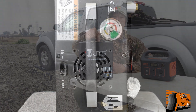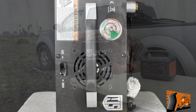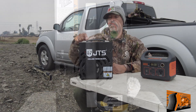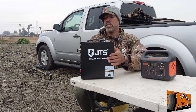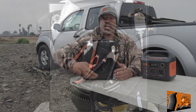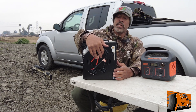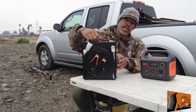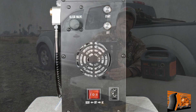There's a switch up top that lets you switch from 220 to 110, which is pretty cool. You can also set your pressure for the automatic shutoff — set it to whatever PSI you want it to stop at. In the back you have your hose, which wraps around a built-in containment rack they made. On this side you also have your 12-volt DC power cord, your on/off switch, and your bleed screw that bleeds the pressure out.